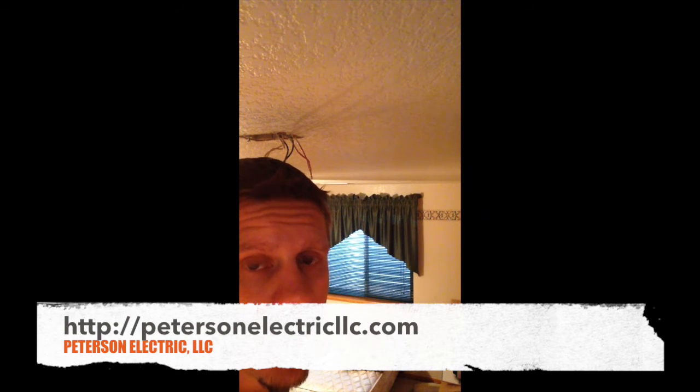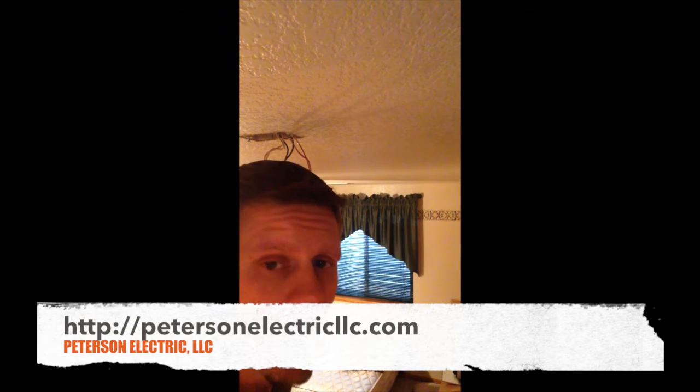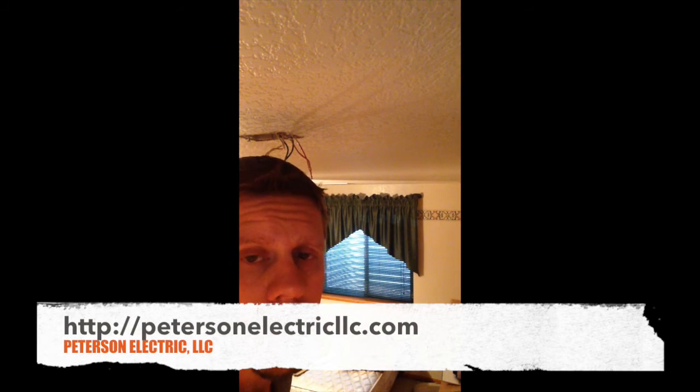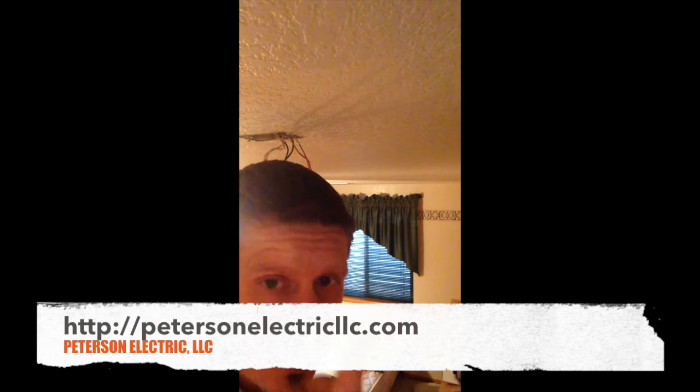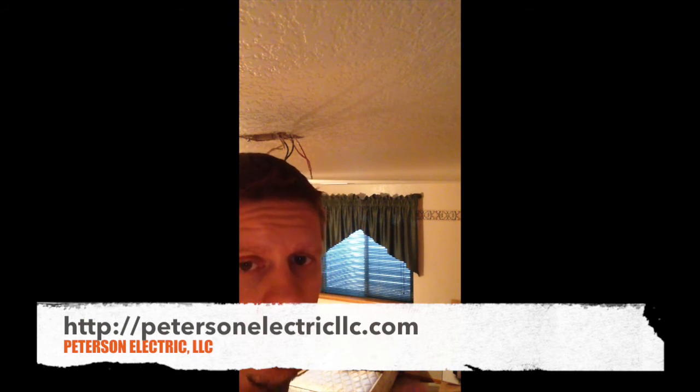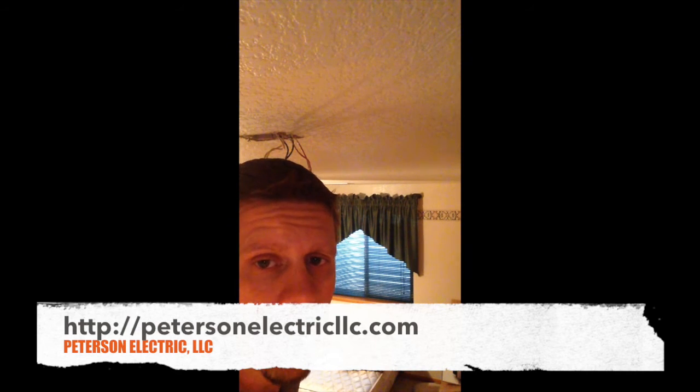I want to show you a trick I just learned: I want to try to signal these smoke detectors without even pushing the button on the smoke detector. The smoke detector button is great — it's like a GFCI; you hit the button, it trips, that's fine. But to truly know if a smoke detector is working, like a GFCI, you've got to test it on the load side to see if it'll react right at that component — that device that's supposed to react at that moment.